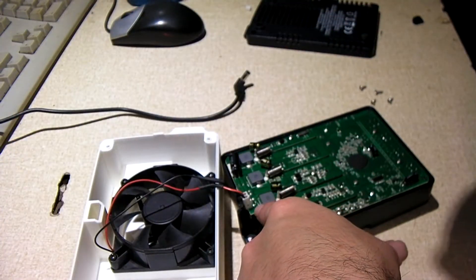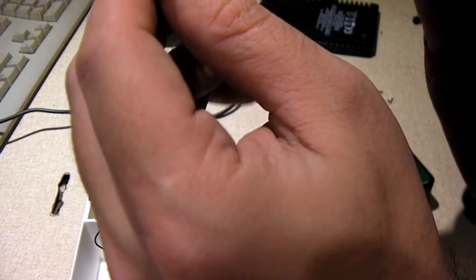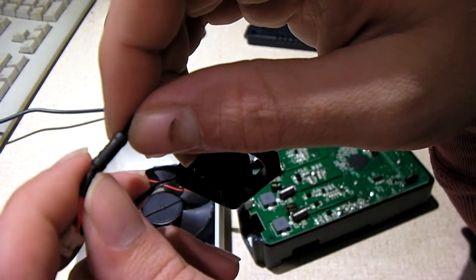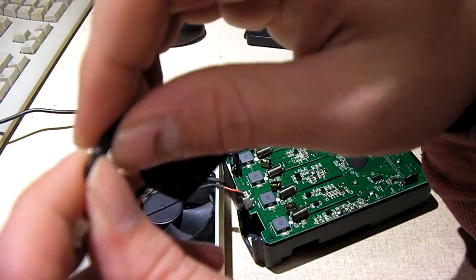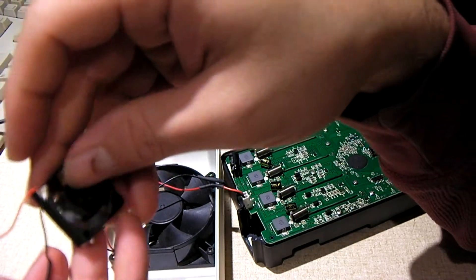This charger actually supplies power for a 12 volt fan. What they did here is they just installed this dropper resistor — I think it's an 82 ohm resistor — and it drops the voltage down to what this fan here can run off of.